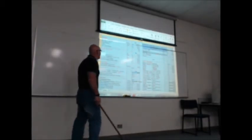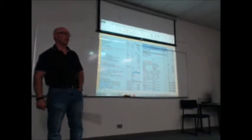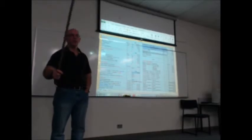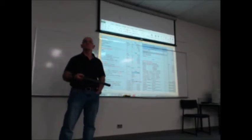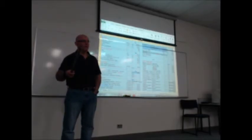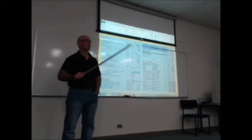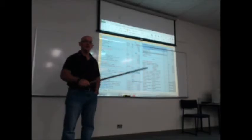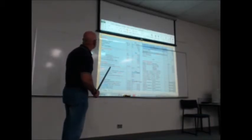Brick cutting, $2 a brick. Nobody does that these days. Most bricklayers carry their own brick cutter. It's just part of the price per thousand. The only time you hear that is if you're getting block work done and they've got to cut the blocks. That's why you have to calculate how many full blocks, half blocks, three quarters, corners, quoins, dots. A dot is a quarter block. How many splits? You need to work out all of them. There's a lot more work in estimating block work than brick work, because one brick will do anything and everything. Price of brick work there.